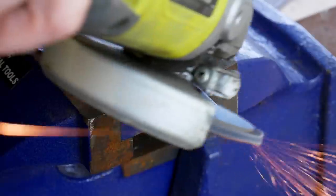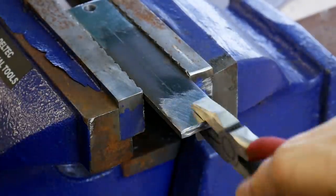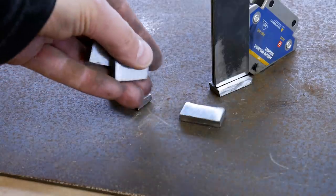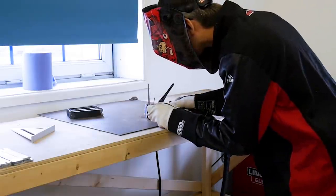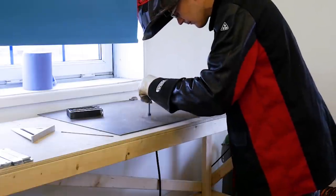and we'll find out why that is in a minute. I need to weld to these, so I cleaned up the ends with a flapper disc in an angle grinder on both sides and both ends of the piece. And I also cut a number of smaller tabs, well actually 16 to match all of the spokes, and those get mounted up and welded to the end so that we get a nice T-piece to fit in that T-shaped slot.